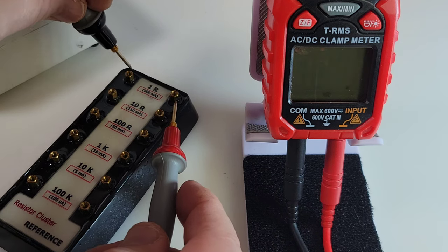NCV mode is next. To invoke it, on the side of the meter we have that one NCV button — press it down once and that's it, doesn't matter what range you're on. Once in NCV mode, start probing for a high power source. When it finds a really good power source it does turn amber once again. Trying it on the mains — that's what you want to see in NCV. And in my deep dark mains panel — no worries, that amber alert just looks amazing.